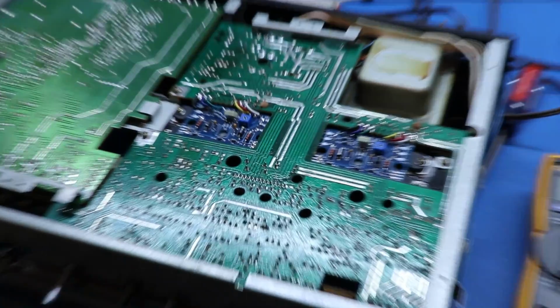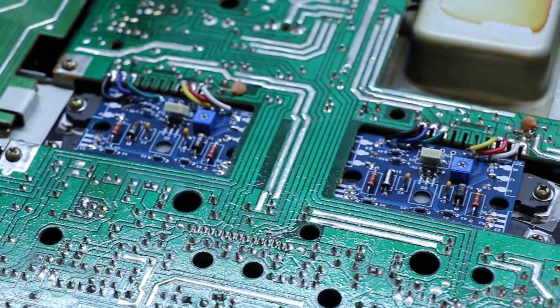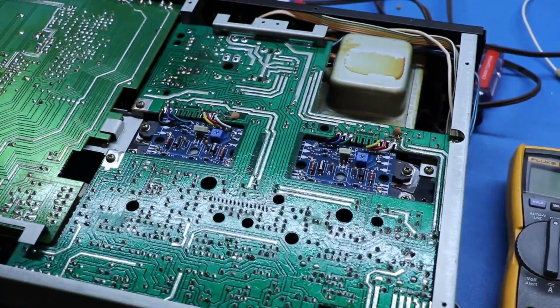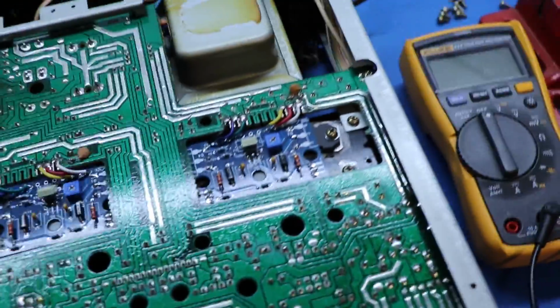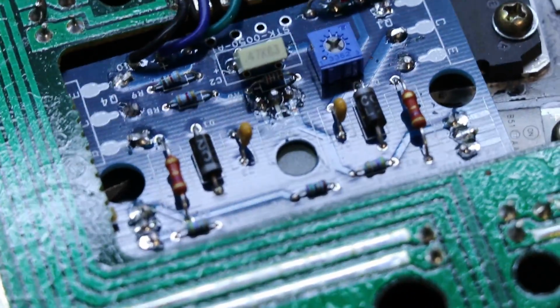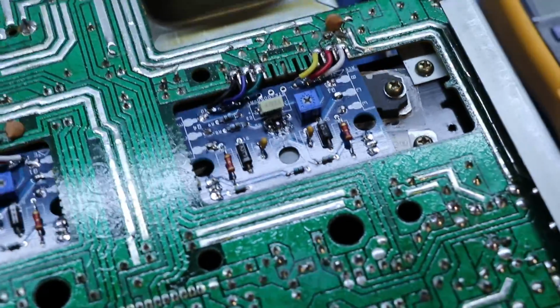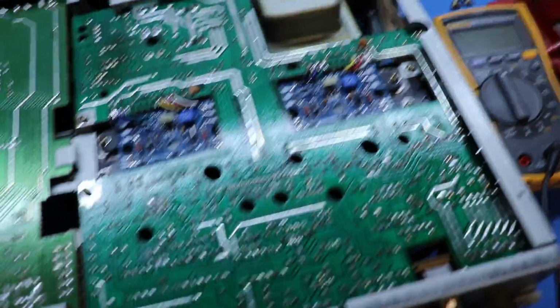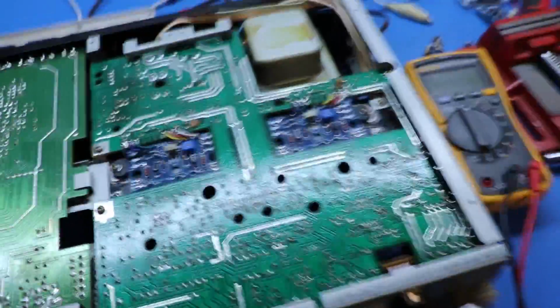Okay, forgive me for not showing you all that, but it was more painful than I wanted it to be. The transistor's in the right place now. What you see there is just a little piece of circuit board material that is the right thickness. I didn't have to drill a hole. Now it's just kind of a compression fit against the heatsink. So now we have thermal tracking.